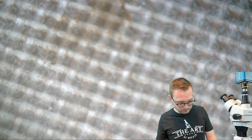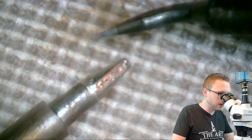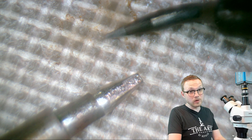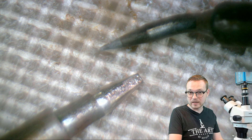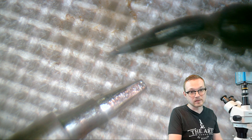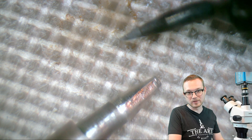Now I'm going to show you two different tips. We've got two different size tips here. Based on your new knowledge of thermal linkage — that bandwidth is going to allow you to transfer thermal energy from the soldering tip to the board — which one do you believe is going to put more power out at the tip? It's definitely not going to be this little micro pencil. This bottom one right here, that one's going to put out way more.